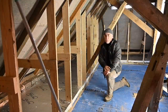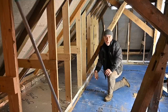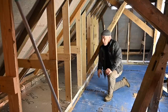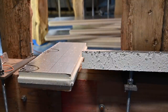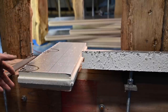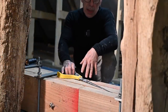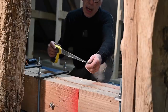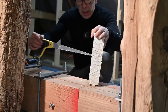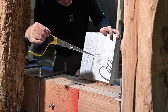We are in the attic of the tower. You can see the roof structure, and on the ground the blue stuff — this is where the oak planks are, which is actually the ceiling for the tower room. I have covered the walls with insulation panels — 6 centimeters or 60 millimeters thick, with an aluminum coat on both sides, and they're tongue and groove so I can fit them together very nicely. To cut these panels to length or cut holes, I'm using a wood saw with a very fine tip. I can punch it through the panel and cut a nice square hole out of it.